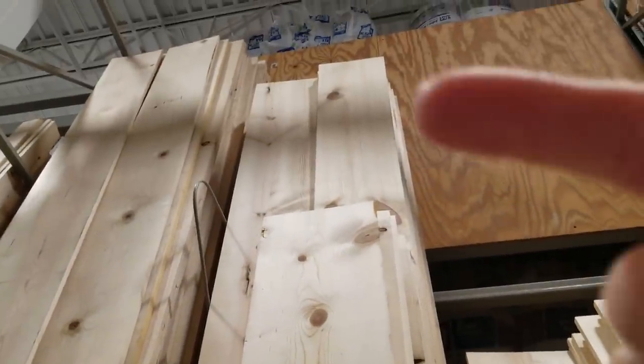This is a home built in the 40s, so nothing is square. Without getting into my mathematical brain trying to figure out what trapezoid to cut, I measured the back wall. Unfortunately, as it comes forward it graduates out — it's a really weird shaped triangle. As it got taller it got narrower, then expanded, then became narrow again. So I decided to just make it simple: cut them all to the smallest size, and the cleats will hold them in place. There will be some spacing issues, but if I choose to I can always caulk it so it can still be easily removed when we move out.